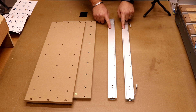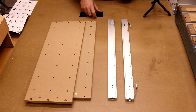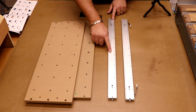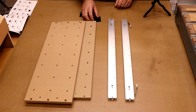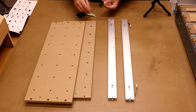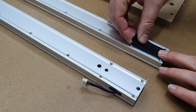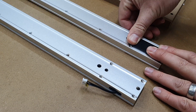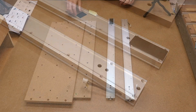To begin, we're going to get the front and rear modules ready to attach the bed to. All we need to do is fix the rubber feet to them. Make sure these are facing with the channel upwards — that's the same on both. Take your rubber feet out of the container, peel them off, and stick them into the channel on either end. Apply a little pressure to make sure they are stuck down, and do the same for all four ends.